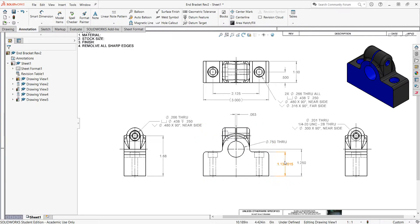For the front view, I need to control how much gets machined off this bottom. So I have a dimension from this cast face to the bottom surface, and that'll control the amount of casting that gets machined off the bottom. I also have a very generous tolerance here because this is a cast surface and I don't want the entire tolerance used up in the roughness of just the cast surface.